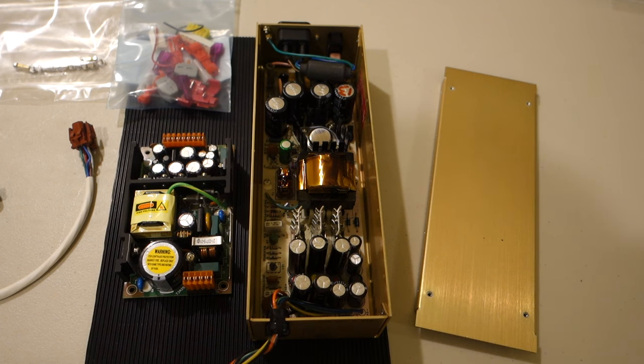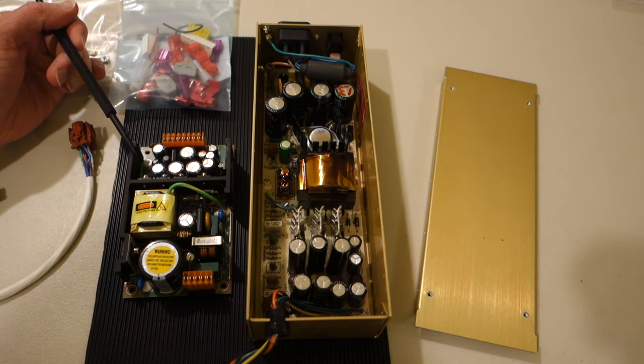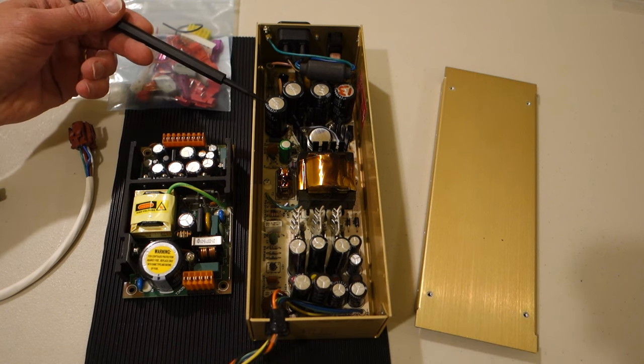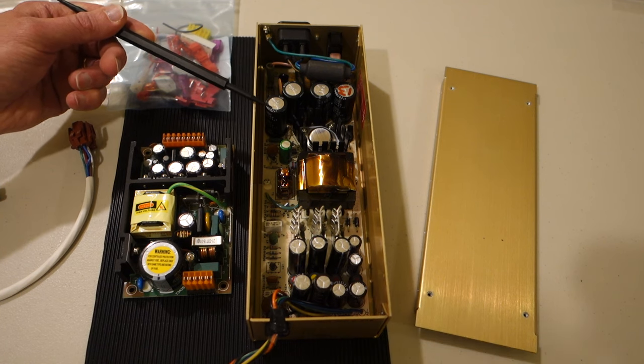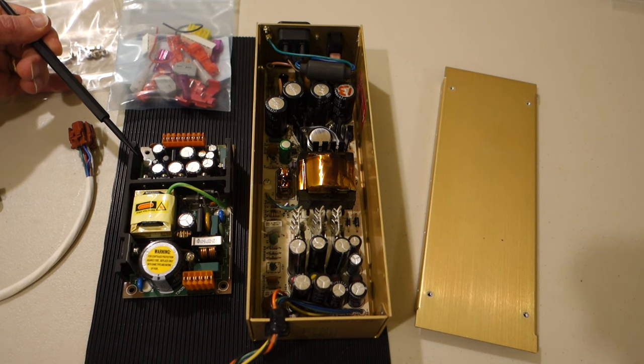All right, so now I've got the lid off of my old power supply, and you can compare the two circuit boards. And you can see what a big difference there is between the old one, which is copyright 1980 from Aztec, and a much newer, more modern board. So if we look at the rated outputs, the old Aztec on plus 5 volts, it's rated for 2.5 amps. On the new Sinpro, it's rated at 6 amps for 5 volts.